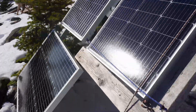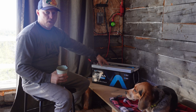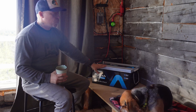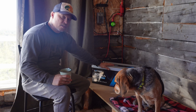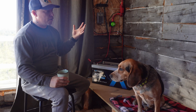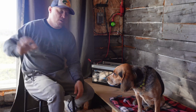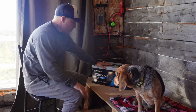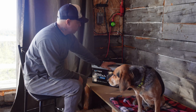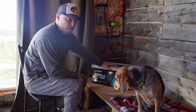The days are starting to get longer but they're still pretty short. The 300 watts charges this battery no problem for what I'm running, but if I was running more stuff the battery would probably discharge faster than it charges. My goal is to add maybe three to five more 100-watt solar panels — I'd like to have 800 watts total. But right now 300 watts is keeping up with everything.